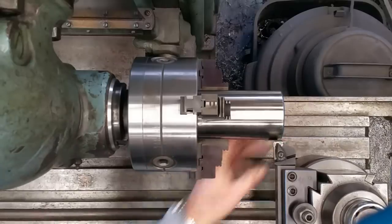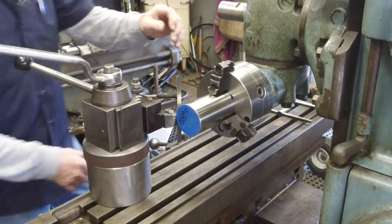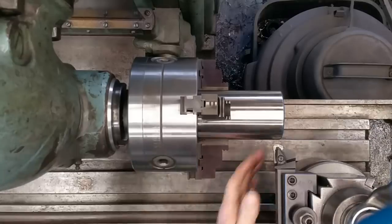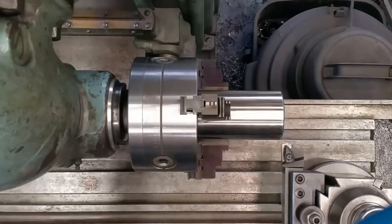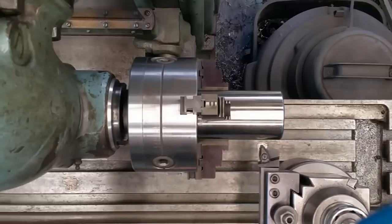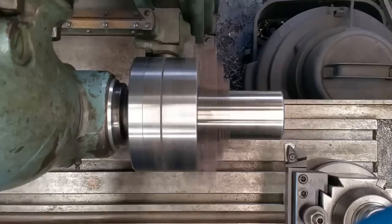We're just going to come in here and touch, and we're going to look at our scale, and it looks like we're on center. We've got a slight little bit of leaning out. I'd rather be just slightly below. All right, let's look at our angle of approach here. Something like that. All right, everything moves freely. All right, we're on the 3.5 inches per minute, like we were facing off that flange for the backing plate there.